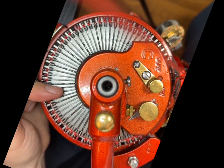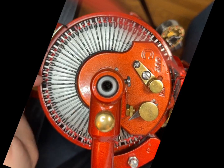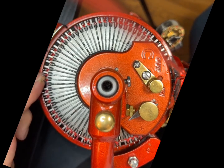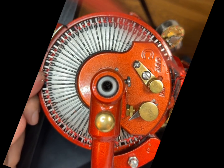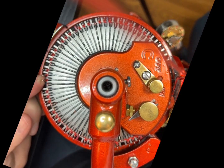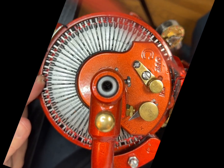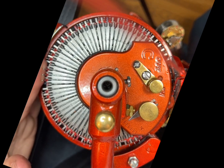So we are doing a recipe here. It's a deep heel. And so what that means, a regular heel might start at the first cylinder needle after 3 o'clock and 9 o'clock. And that would technically be this one I'm playing with right here. But we're doing a deep heel. And we're setting up the pre-heel. And you're like, oh my God, you're doing it way in advance. Yeah, and there's a reason. We're doing the pre-heel setup. The pre-heel has the same style of needles as the heel will. So this is why we're worrying about this now. We are going to add 4 cylinder needles to the heel. Yes, I said that right.